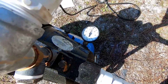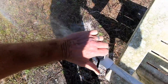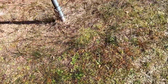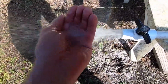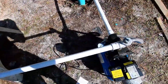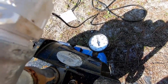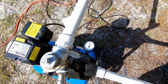Now we're just going to let it run for a while and see what kind of flow we get. Wow, you can see that water — it's shooting out all the way back here. Beautiful. We're just going to let it run and see if it clears up. Also, I want to see if we have sulfur water, so let's just smell it. It smells pretty clean — real clean. Pump just kicked back on. I think this pump's set for about 20 pounds — that's when the pressure gauge will kick it back on again. We're doing really good.